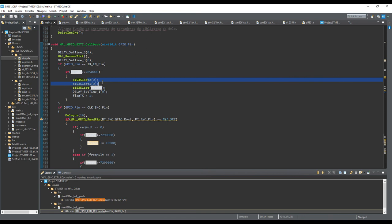So here, when I'm using the transmission, I have to reset, okay, to release those two outputs for the reception part of the circuit, which is the BFO and the intermediate frequency, and I have to set my transmitting carrier to the decided frequency I want to transmit. I will reset this timer and I will set this flag. So every single time you are sending to this part of the interruption, you are setting this information here, every single time.